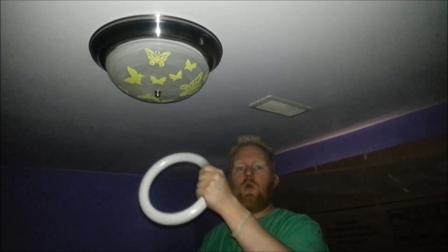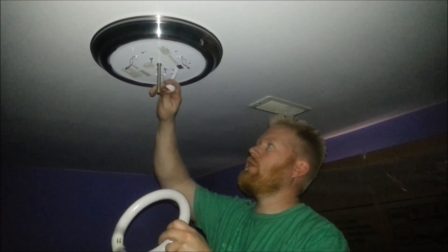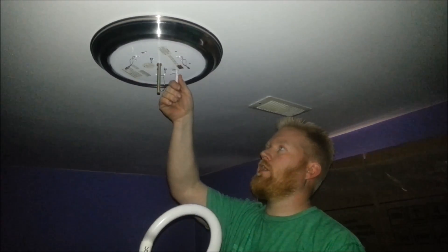A lot of times just replacing the bulb and/or ballast can cost more than the fixture does. So make sure the power is off first. I've already pulled the bulb out of here — it just plugs in with a little four-prong thing — and right in here is the ballast. But what we're going to do is eliminate that once and for all and just use regular CFL bulbs.